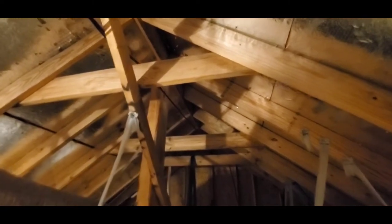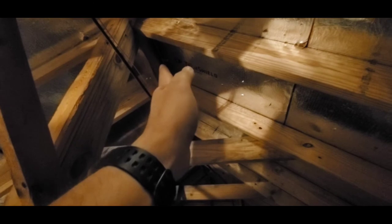Another common deficiency that you find, and again, a lot of times with older homes, is this board that's going along the ridge. That's called the ridge board. And these rafters, they're cut at an angle and they snug up to, they're nailed to that ridge board. Sometimes the angle of the cut, especially on a steep roof, is very long, so that rafter board hangs over the ridge board. Now that would be marked as a deficiency.